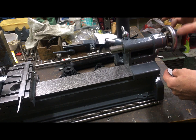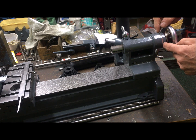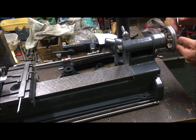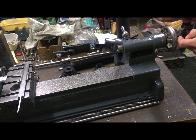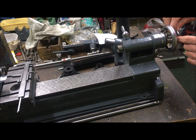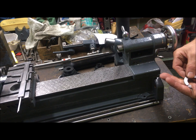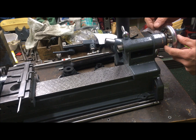The screw doesn't wear that much, but maybe I'm wrong. Anyway, this was replaced with some new, which of course then fitted better in the groove there on the barrel. But I had to widen this gap a little bit, so I measured how much and then widened the gap — which is how much I needed to widen these to fit into that gap on the barrel first. Then made this, cut in two of course — made a ring and cut in two. And then I increased the space here by that amount with the file.